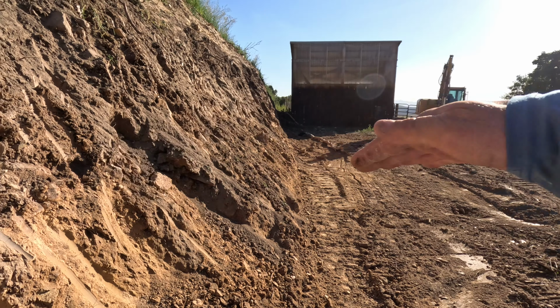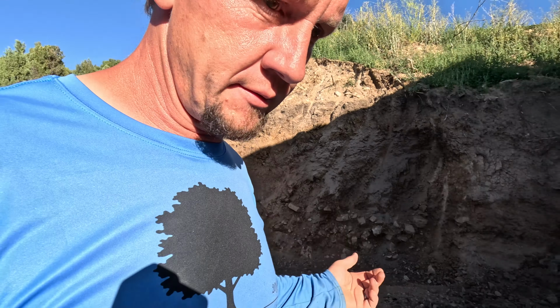Something like that. But I'm gonna call it a night, go get some supper, and tomorrow I'll come back at it, grab that ripper and break all this other loose and get it pulled up and set off the side. Now this shoulder was built out about 2 feet, 3 feet from the fence posts originally, and over the last year or two the cows and the goats have walked it down and kind of settled it and through the winter and everything. So I just built it out even more, and they'll do the same thing, but they want to walk on that edge, so I've got to have more than a foot and a half or so, because they'll walk on it even if I only have 6 or 8 inches and wear it down and undercut the fence. So we're out wide enough now, that shouldn't be an issue going forward.